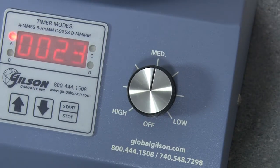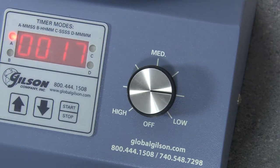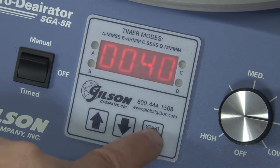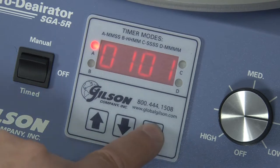The rice shaker features a vibration amplitude control to set operational vibration levels necessary to dislodge entrapped air without sample degradation. It also features a digital timer with a large LED display and a mid-cycle pause function. For convenience, once the cycle is completed, the timer will automatically reset to the desired test time.